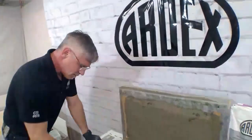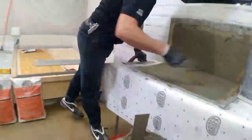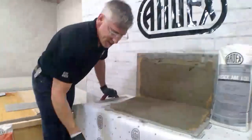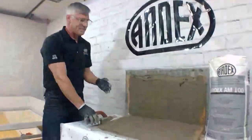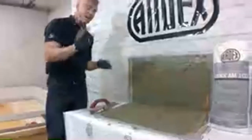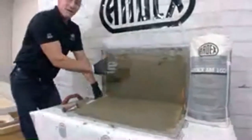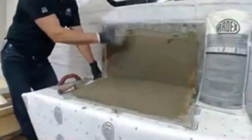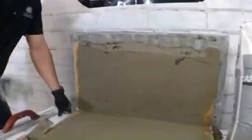The first is, what is the working time of AM100? So it is a rapid setting product. We're going to have a working time of about 15 to 20 minutes. Now, my trick with AM100 is to rough place it like I've done here, and then watch it and come back to it in about 15 or 20 minutes. And then I would take my steel trowel and I would close the surface.